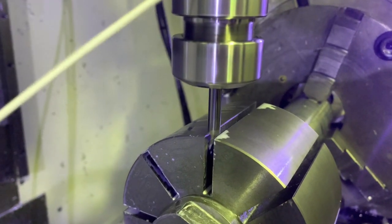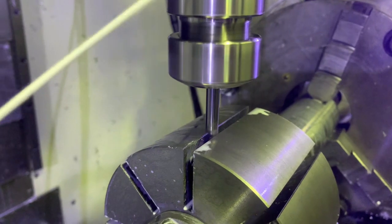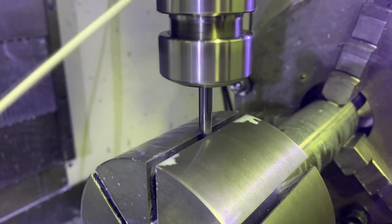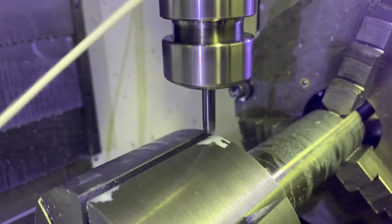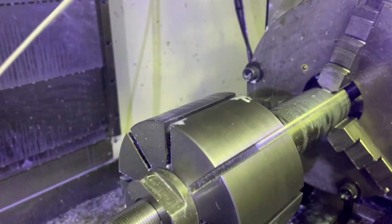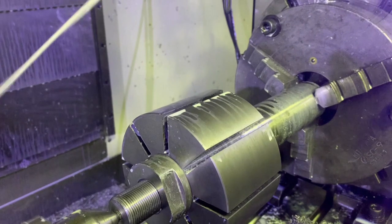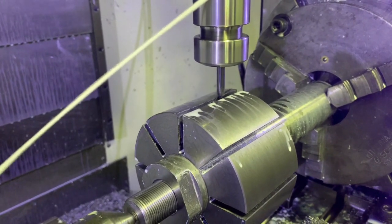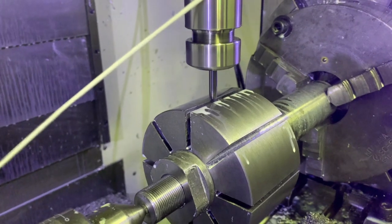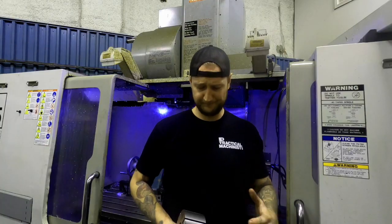I believe it's about 30 thou. So we use a solid carbide tool to go in and put all these rads in there on the machine before we take it out. You could theoretically try to file these on or belt sand them on or something. Always, always, always go for consistency, guys. So we go ahead and we mill those on with a rad cutter.